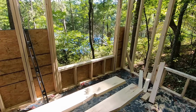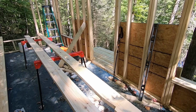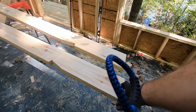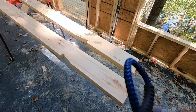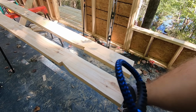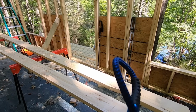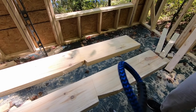All right. So far through all that mess, what we got accomplished is, this is the front, and I want an 18-inch overhang, so this is 16 inches from here to here. And then I'll have a 1.5 inch fascia board, because then it'll be covered with some kind of metal. So I'm not going to put a fancy fascia board on it, and the fascia board will be painted black too. So, front bird's mouth.